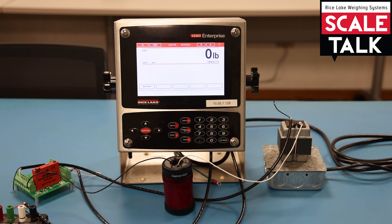In this setup I've created a small and simple batch routine with two set points. The first is a weight-based set point. The scale is a 10,000 pound scale that counts by one pound increments, and we have a set point configured for 4,750 pounds.